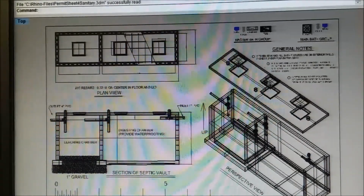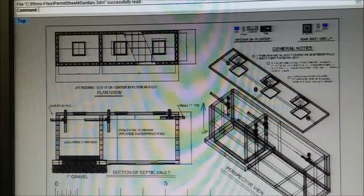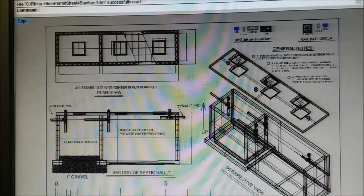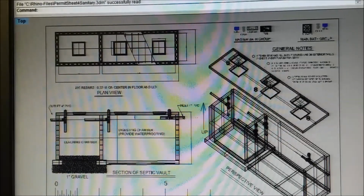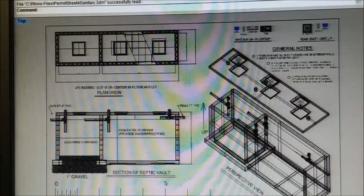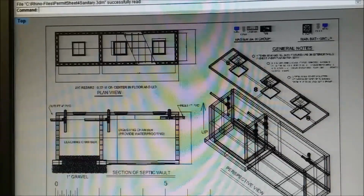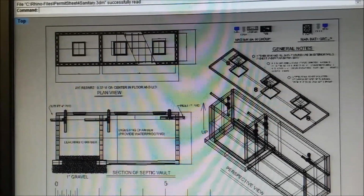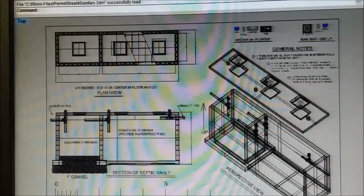Okay, the transfer out of the digester into the leaching tank, or your secondary digester if you use one, has to be down well below the surface but off the bottom. Floating poo is on top. You don't want to send that to the second part. Gravel, sand, bones, all that kind of crap is in the bottom of the digester. You don't want to suck that up and send it into the next part. You want to confine all the problems to the digester, the thing that people come by and put a truck to and suck it out for you.